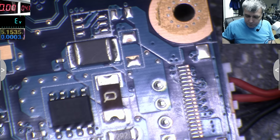So don't get me wrong, if you want to be a hero, find exactly the problem and you have time, do it. Absolutely. There's a lot to learn from finding exactly the fault and not using a shortcut like how I'm using a shortcut to get the laptop working. I'm just speaking about the input part from the charging port. That's all. Because the other things are a little bit more complicated, but most of the faults are here on the input part.